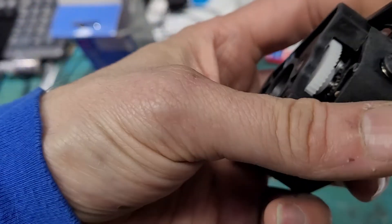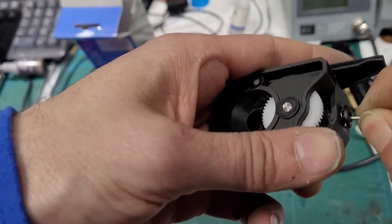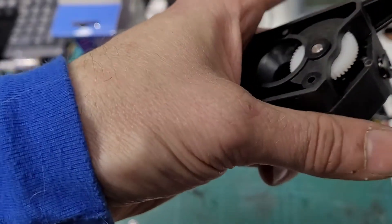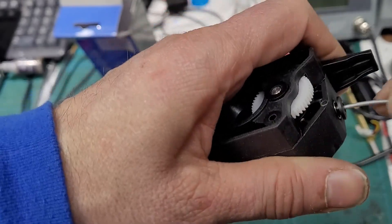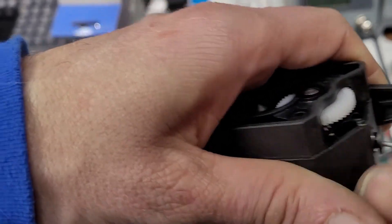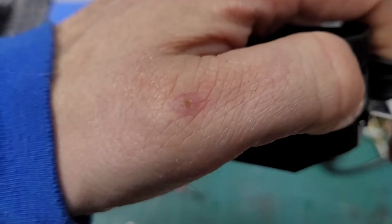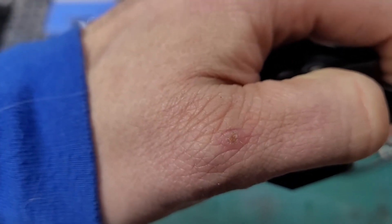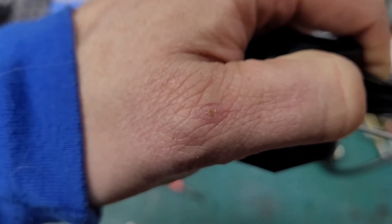If you assemble it and take a piece of filament - you could put the spring clamp on if you want but I tend to just push it in - and then squeeze it together. If you can just pull the filament out without the gears turning, that's obviously not binding and it's too loose. But once it's starting to bind and grip the filament and turn the cogs, you want to squeeze this, hold the cog, and try to pull it out. You can see that's a lot of force and it won't come out - so that's definitely got it.